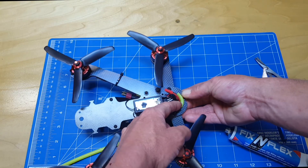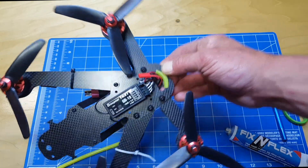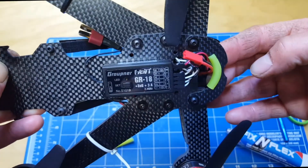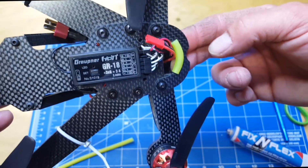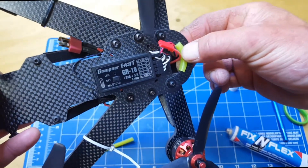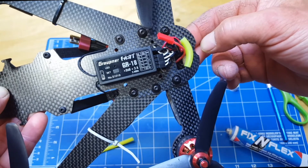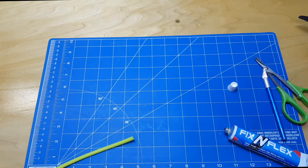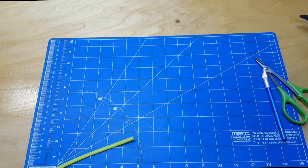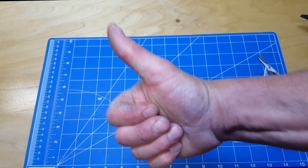There we go — I'll force the opening of the fuel line onto the edge of the frame. Now I'll take a couple of zip ties to hold it down while it cures. You can see the silicone wraps nicely around the edge. I'll hold it in place until I get the zip ties on, then take them off tomorrow once it's cured — maybe add a little more if needed — and be ready to rip. There you go: a couple of different ways to seal off frame edges and prevent wire chafing, to avoid crashes for no other reason than dumb thumbs.